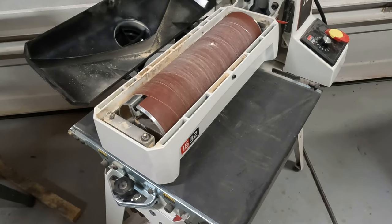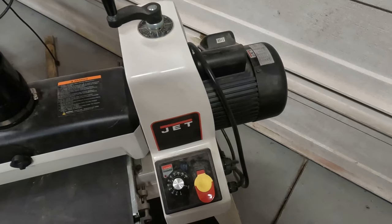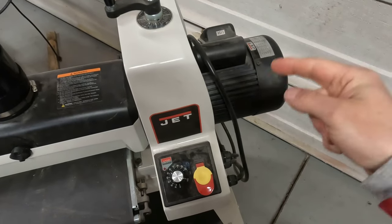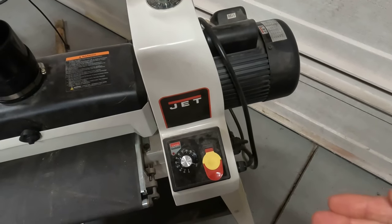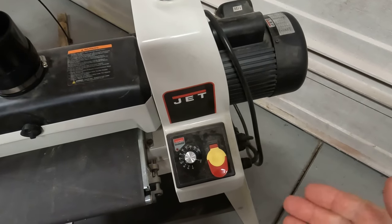To get the least amount of snipe, you want those to be almost as loose as you can get them. Tip number three is to take shallow passes but keep your speed going pretty good, especially when doing end grain. I keep my speed around 50 or 60 and it avoids burning.